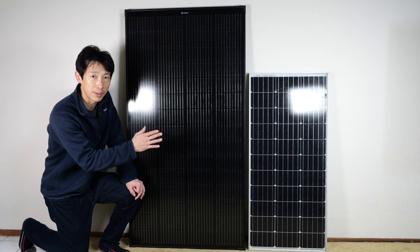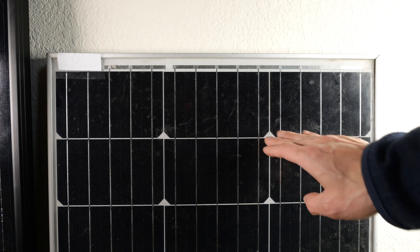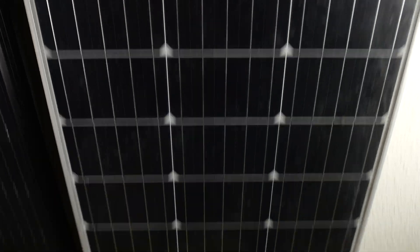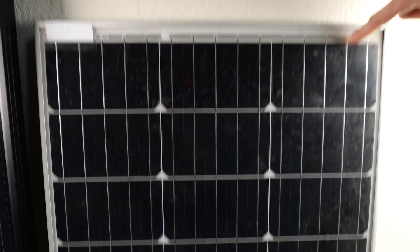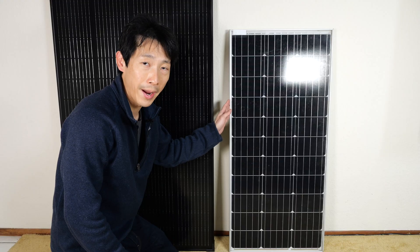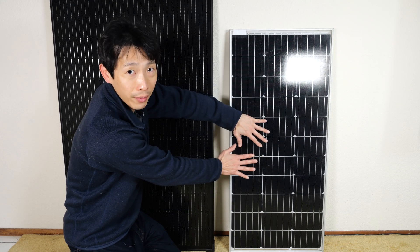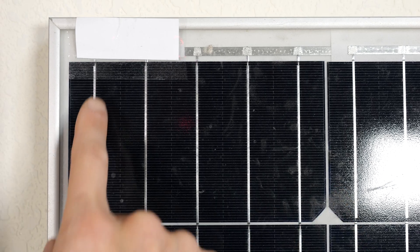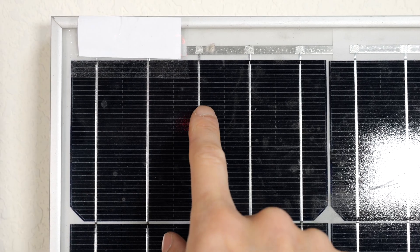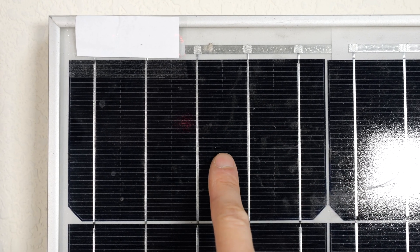Here's another comparison with a different solar panel. This one uses half solar cells but it's not resistant to partial shading. It starts here, goes all the way down, loops back over, comes back up, this bar connects two strings, then goes back down — running a wire from down there all the way to the connection box. This panel is one long string of 33 half cells, so any partial shading will wipe out all the energy. At least it has five multi bus bars, though there is a disadvantage with having really fat wide bus bars because they block light from going into your solar cells.